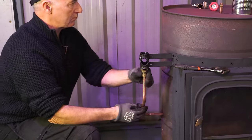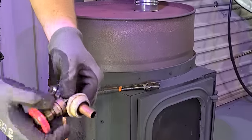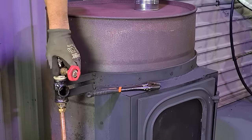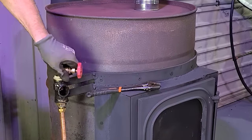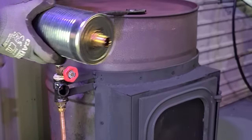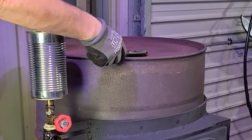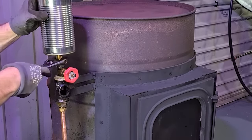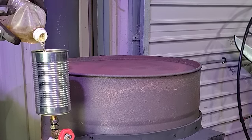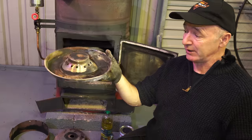We're installing the half-inch oil feed to the burner, reassembling the gate valve with a slot, and tightening it into a malleable iron fitting. That's just a half-inch tank connector in a dog food tin — tighten the nut, and I'm filling it with used vegetable oil.